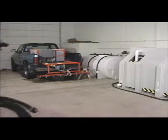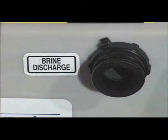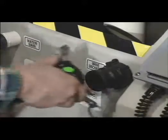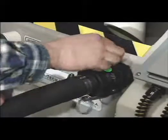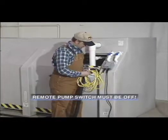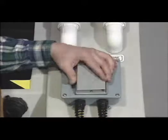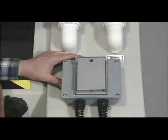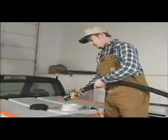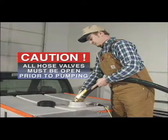Once the main brine tank has been filled to the desired level, pumping the brine into a truck or storage tank can begin. Connect the fill hose to the quick disconnect coupling and connect the other end to the truck tank. If the truck tank or storage tank is not equipped with a 1½-inch quick disconnect coupler fitting, other attachment means must be utilized. Make sure that the remote pump switch is in the off position with the toggle switch down. Push in the reset button on the ground fault interrupter receptacle located beneath the waterproof outlet cover on the electrical junction box. Open the hose valve all the way. All hose valve connections between the system and the tanks must be opened before turning on the remote pump switch, or excessive back pressure on the pump can result.